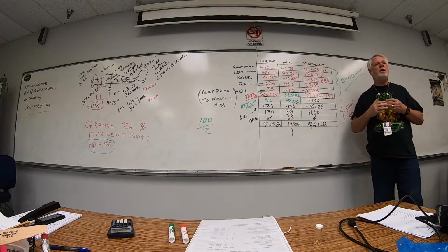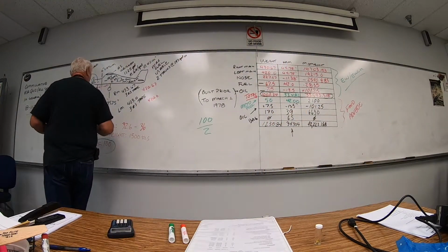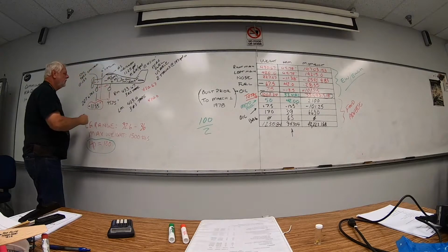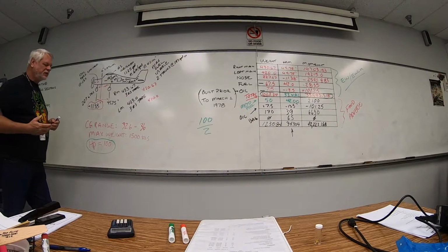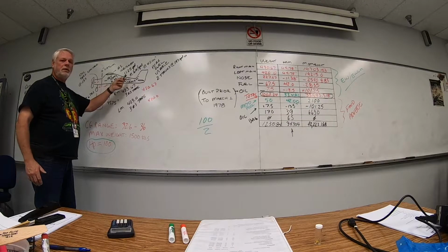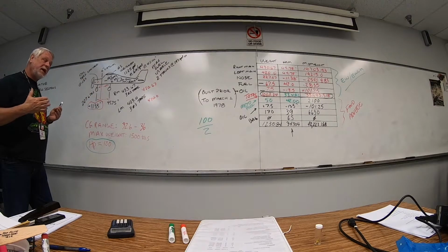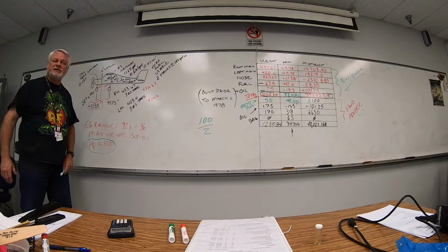Now we're going to look at our rear adverse check. So by definition, for your rearward adverse check, anything that is located aft of your rear CG range, which in this case was 36 inches, anything located after that, we're going to max out now. There's still some things that we might have to have. Now our fuel, it's at 42. If it was in your CG range and not aft of the aft limit, then you're going to use METO fuel there as well. But in this case, it's at 42 inches. Our rear limit is 36, so we're going to have to max that out.